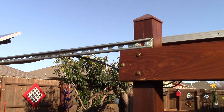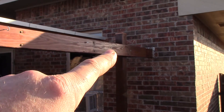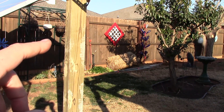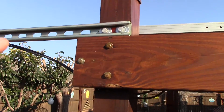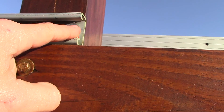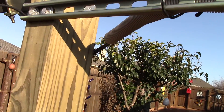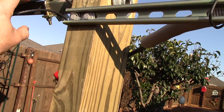This big array here is really solid because I have it bolted to the side of the house, so the whole structure is solid. But this section was just a touch wobbly, especially on the top, and I didn't like that. So I went back to Lowe's and got another piece of super strut and three-inch long lag bolts — five-eighths — with galvanized hardware. A little pricey, but they're going to last, and the structure is really, really solid. The cable is going to go right in here on the inside and just strap in, so it'll all be covered.